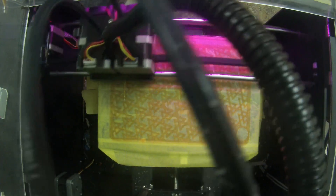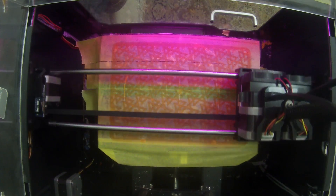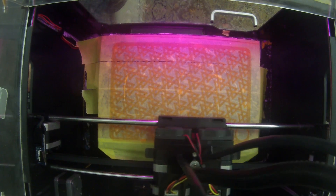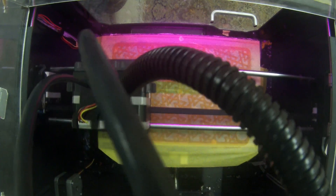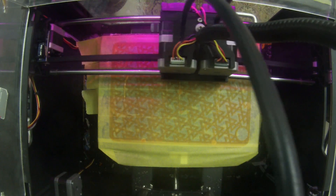Let's go back to the iPad case. After reading a little bit, I discovered that larger prints will incur noticeable shrinkage, which can affect the performance of measurement-specific parts. While some designers accommodate this potential shrinkage in their design, this one did not. I'm going to increase the size by a very small percentage and see how it fits a second time around.